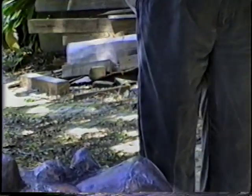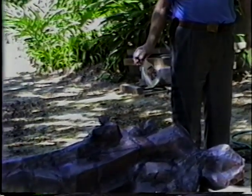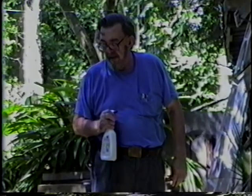Now, this has already had a dark patina with liver of sulfur, sulfurated potash it's called. And very active. It smells like rotten eggs. And if it doesn't smell like rotten eggs, it's not any good. It's gone bad. It'll go bad in solution. So you take a little piece of yellow colored rock, which is the form that the liver of sulfur comes in, put it in a solution, let it dissolve, and it will work on copper.